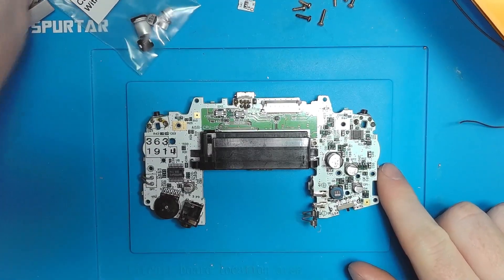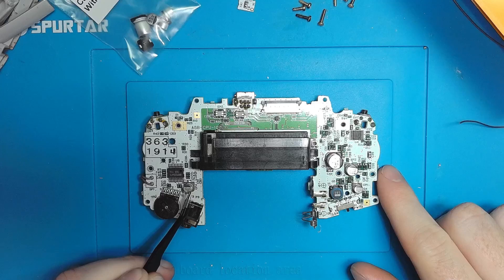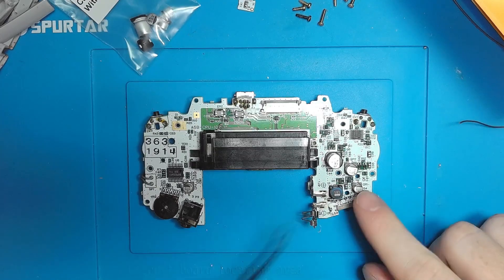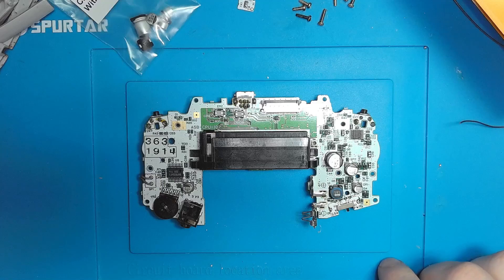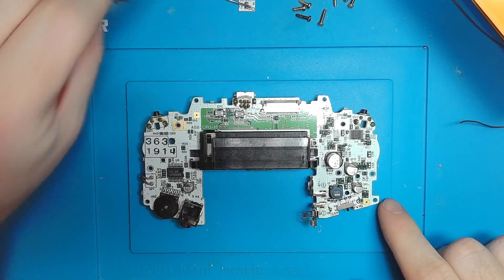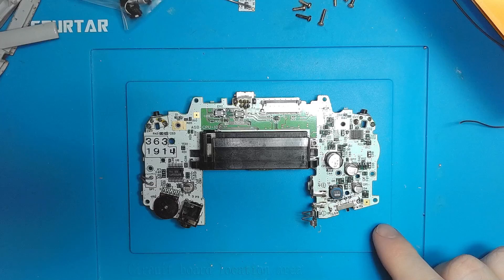So what we're doing today is replacing these capacitors. We'll give it a test just to see if that's all it needed to fix the power cycle issue. We're going to get zoomed down the microscope, but we're going to start with this big fella here, then move on to this one, and then these two — these last two are the same size. If you get a replacement cap kit — I don't remember where I got these because I re-bagged them — you can get cap kits from Retro Game Repair Shop. I think Helder's Game Tech has them as well. There's plenty of places, just do a search. I'll put links in the description.